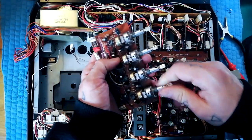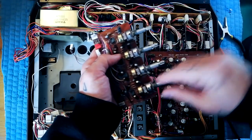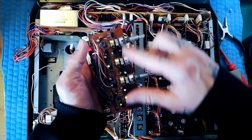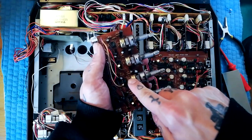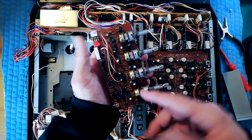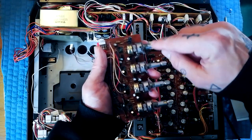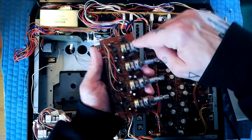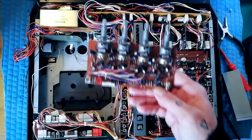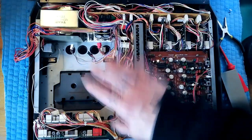You would just go about this the same way. If you don't have a lubricant, avoid putting contact cleaner on these because there's grease in there — the contact cleaner can eat that away and then the metal parts will actually rub against each other, which feels horrible and can manifest itself in audio problems. But you could just blow any grit or dirt out of here with contact cleaner and then compressed air. It would probably be okay without lubricant, but ideally you would have some kind of lubricant handy and put that on the shaft of these after they've been cleaned and in these cavities, which is actually where you've got a wiper going across a carbon plate. Refer to the other videos I've done on that cleaning process — I was really just wanting to give you an overview of what's happening in that circuit board and a bit of a heads up about how you would remove that.